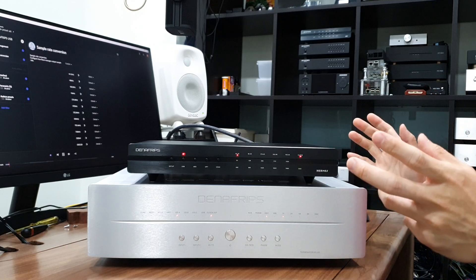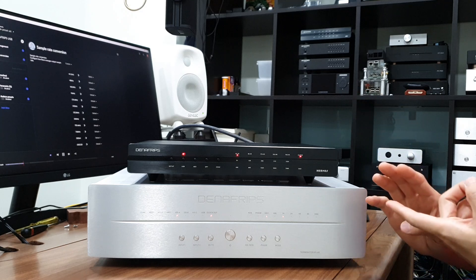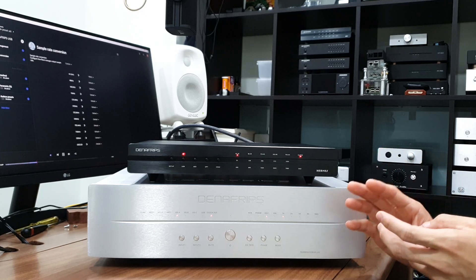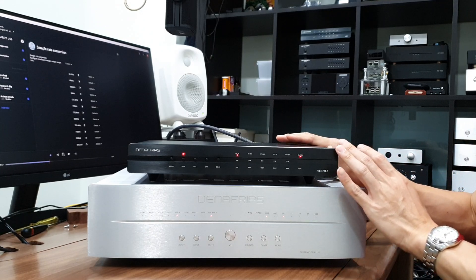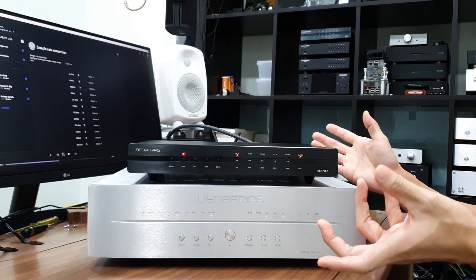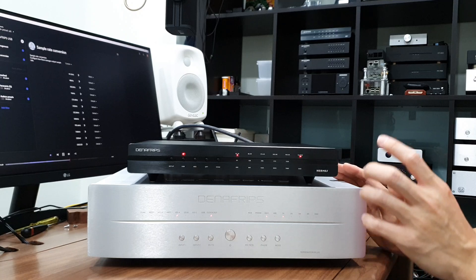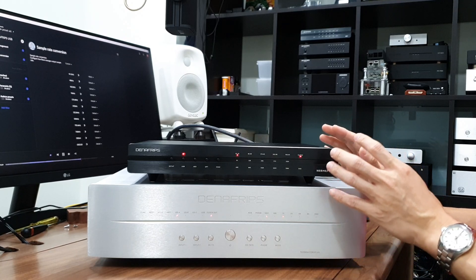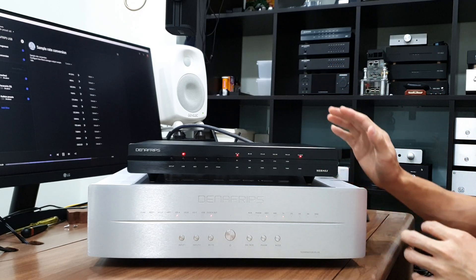If you use I2S and clock synchronization, this video is mandatory for you. The I2S pinout has to be configured correctly for both PCM and DSD playback, otherwise a mismatch will generate loud noise, and that loud noise may damage your loudspeakers. My suggestion is to always turn down the volume to minimal but audible before you configure or use the I2S of your system.